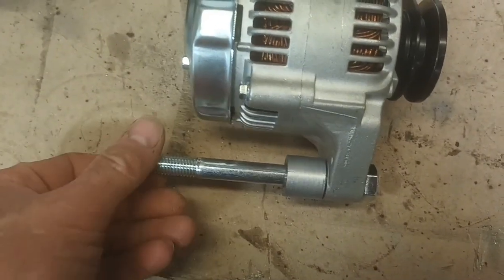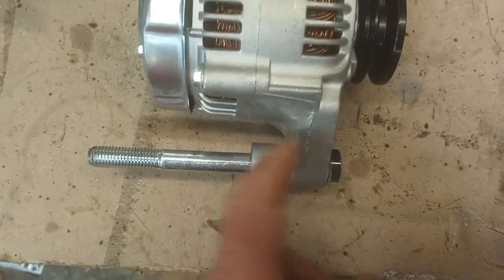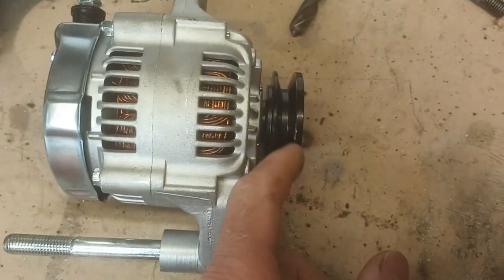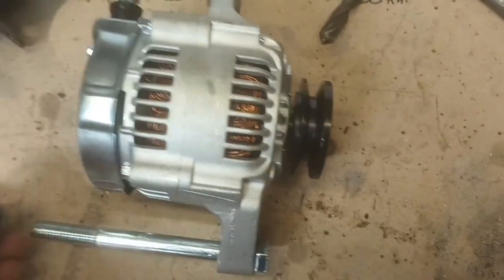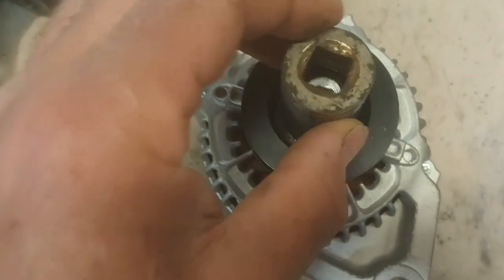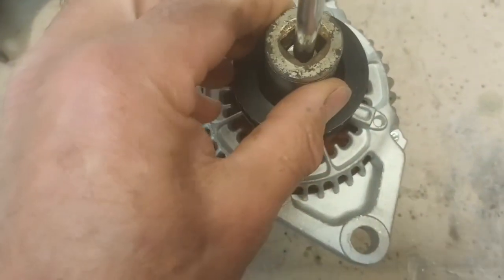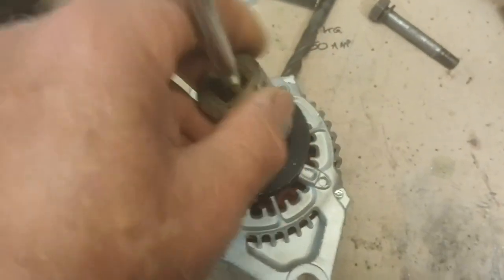That spacer there is about 21 millimeters, which will make all the pulleys line up. The next thing I want to try is to make this groove wider. Ideally I want to get that pulley off, but I can't move it. There is a hex in the middle there and I've tried a hex on there, gripping that, and some mole grips on the outside - it's very tight. I think something might break first; ideally I'd need a swan neck to get onto that and get a decent socket on.